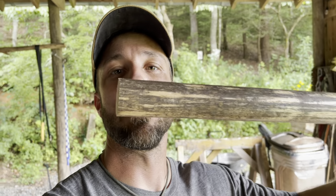Most of the time handles come with a wedge and then a little metal step wedge. This one did, but whenever I buy handles, I always buy them in twos because inevitably you're going to have to replace one. But this one has been floating around my barn for the past couple years and been moved around quite a few times, and the wedge and step wedge have gotten lost. So I will be reusing the step wedge that came out of the axe, and I'll be making a wedge out of the old handle.